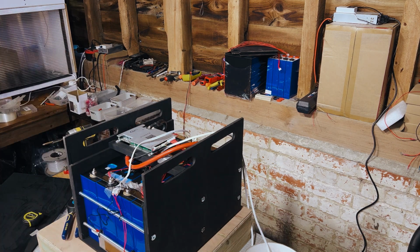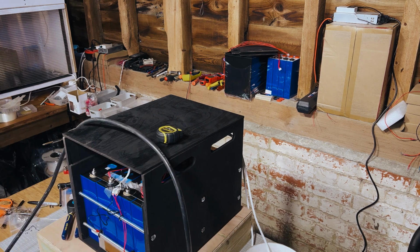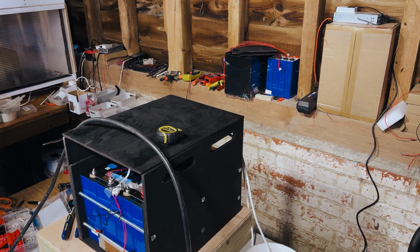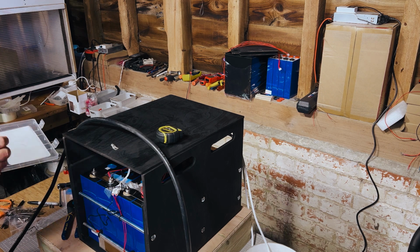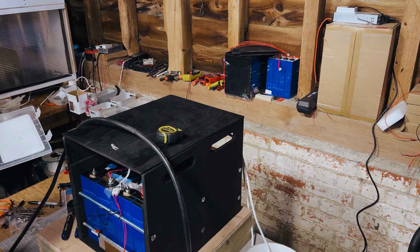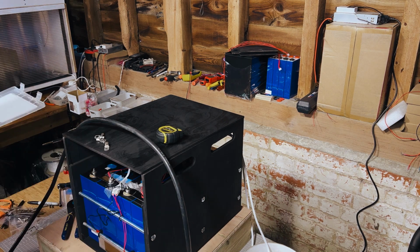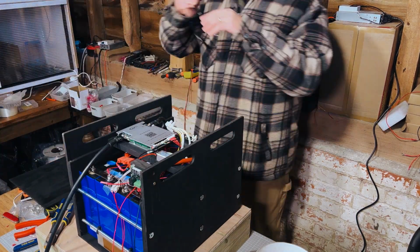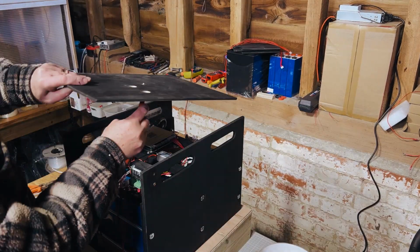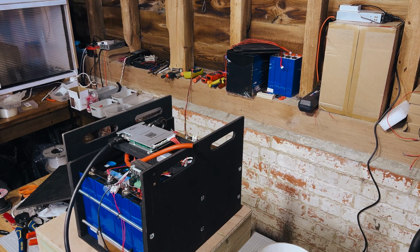With this battery build, we decided to put those in just for the heating pads, so that if the customer has any issues, if a heating pad goes or something like that and he needs to replace one, then it's easy for him to debug and disconnect one, test it, things like that. So that was intentional. It's not just a case of we don't know what we're doing. We used those intentionally so that he had the opportunity to debug it. Made sure everything was mounted correctly inside there, and then we start the process of putting the lid